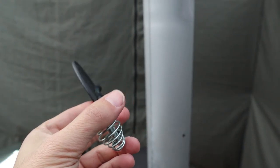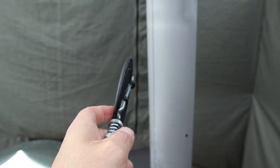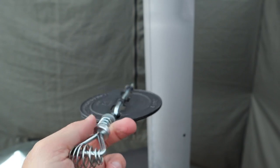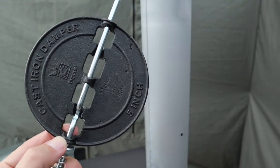When they sent my stove, they forgot to send the damper. The damper is what I'm going to put in next, and I'll show you how to put it in. It's pretty simple, especially since the holes are already drilled in there. The damper allows you to keep more heat in — you still allow the smoke to go out, but you can increase the heat by closing it a bit. So I'm going to put that in.